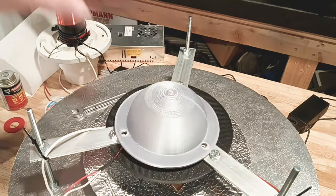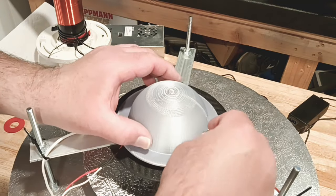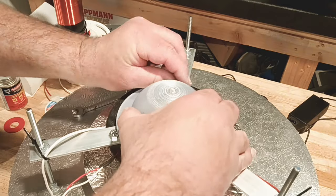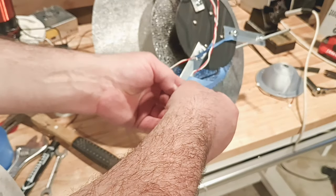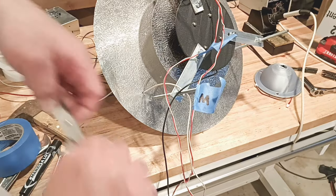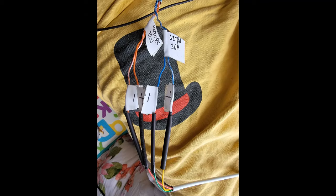Now that our piezoelectric piece is dry, let's go ahead and put on the cap. You'll see I have the wires over here to the high voltage side — I went ahead and changed that so they go out to the motor side. Once that ultrasound cap is on the top, you feed the wires through. Just make sure you mark which one's the ultrasound and which one's the motor. Before we went any further, I just wanted to tell you which wire we were using — it's 20 gauge wire, for a doorbell. It's solid inside, not frayed wires, and it's because of what was used on the original Graviflyer. Looking at the picture of his original, you can see the wires — they're actually for a telephone cable, the same type of wires. That's what I used.